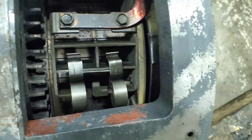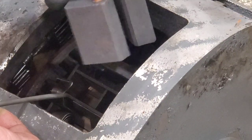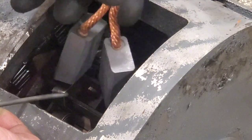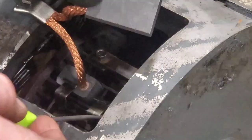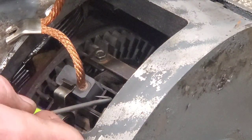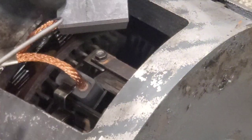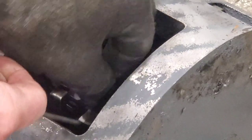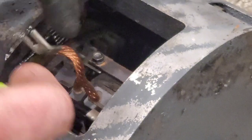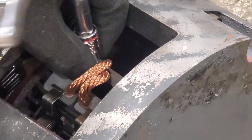Here are the brush holders and we've got to stick the brushes in there. You can easily do this with your finger — use a pick to hold it up and out of the way and get the new brushes stuck back down inside there. The old brushes — you can see how far the new one sticks out here. They stick out quite far. The originals were about that long, so they were fairly worn out because this lead actually goes down inside the brush. I'll pull this up, drop that in, and the spring keeps pressure on it. Then I roll this right here, stick it in, and there we go.